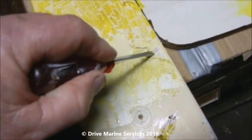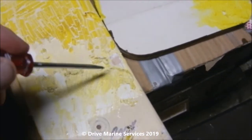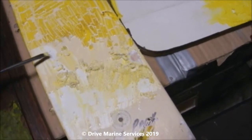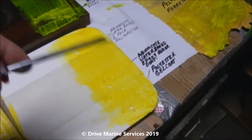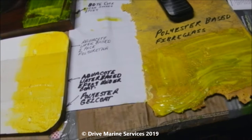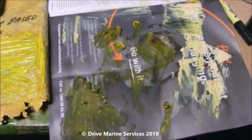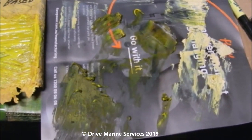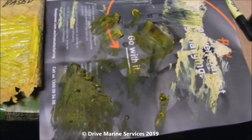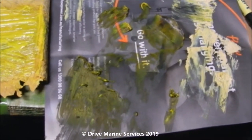It's starting to get through the undercoat — we're pretty well back to bare timber. About 15 minutes and we got some pretty good results. Next I'll cover these with plastic so it doesn't dry out — it's important it doesn't dry out, because if it does it'll stop working. The contamination you scrape off is where the toxic stuff is; the paint stripper itself isn't very toxic. It comes into its own especially for anti-foul, which is highly toxic and difficult to remove, and for lead-based paints it's absolutely brilliant.